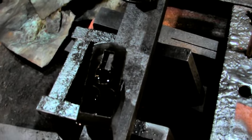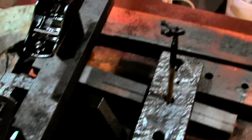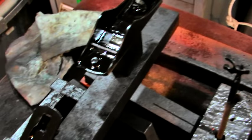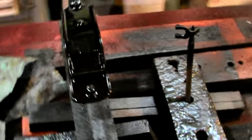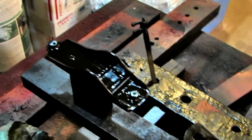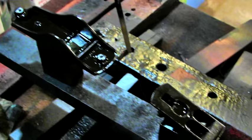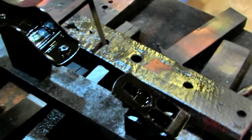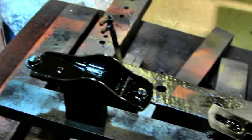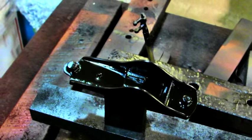I'm going to end up putting anywhere from usually about 6 to 8 light coats on the parts. There are several Japanning recipes that you can find if you search hard enough. I don't use them. It's taken me several years to come up with a finishing technique that I like that gives the same look as Japanning. But the modern finishes are better than Japanning.